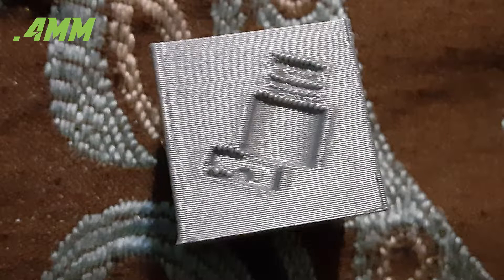And here we've come back to our middle model. This is the 0.2mm layer height. This print took about 38 minutes, which is a happy medium. Notice how the layer lines are only slightly visible, and the lines can be sanded away in post-production, leaving a viable end product. The time was almost half of the 0.1mm model's print time.